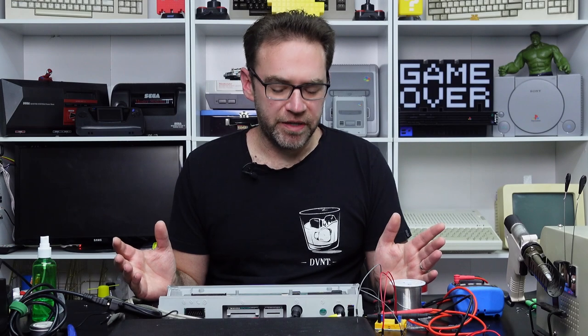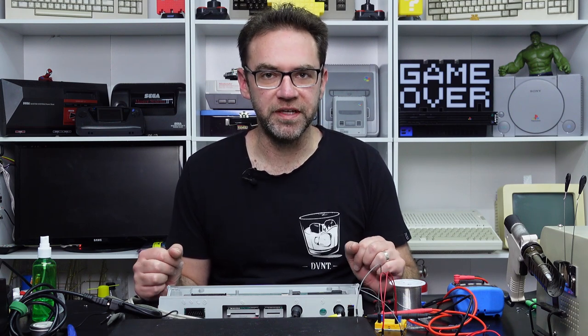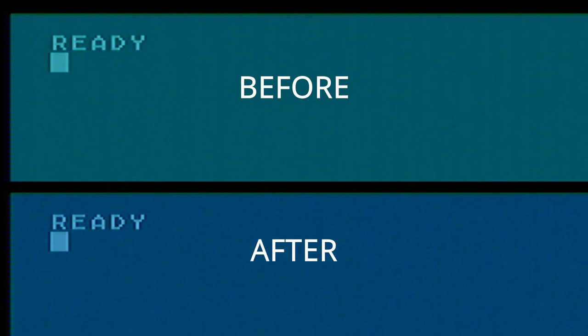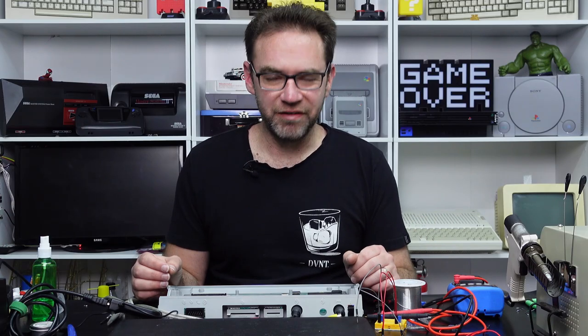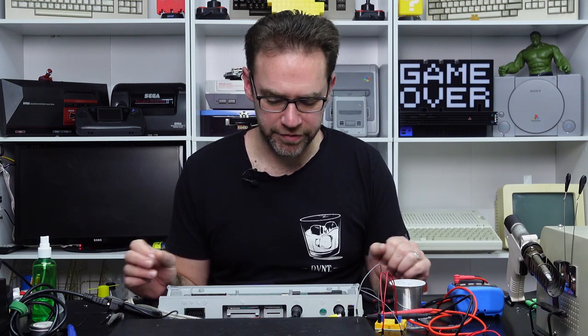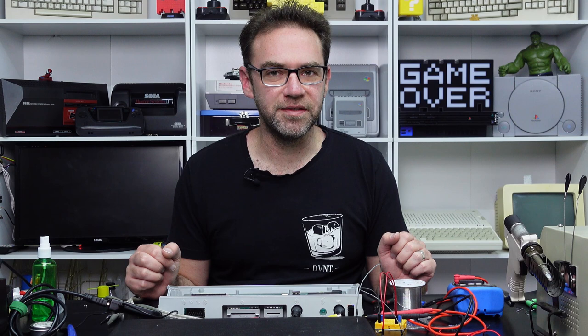All right, so I spent a bunch of time stuffing around with the supervideo modded XE, and I determined that the best way to improve the supervideo mod is to just rip that out and do this mod instead. It seemed to be the obvious choice, but I still stuffed around and filmed a whole bunch of stuff trying to improve that mod. But the reality is, it was done at a time where chroma luma monitors were common and you couldn't really see that much difference on a CRT, but with flat panel displays now, they show up every tiny bit of interference and noise. So yeah, if you've got a super video modded XE, pull it out, swap it for this one, let me know how it goes.